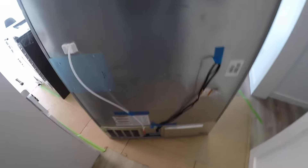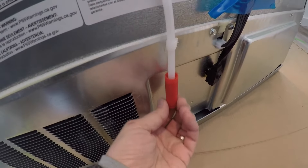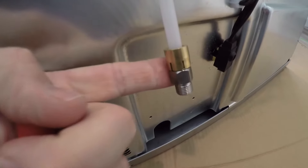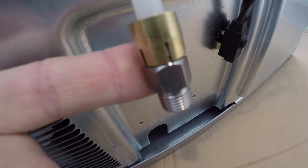This is a new house, and that's the ice maker water line valve right there. And this is the back of the refrigerator — you can see here this is the water line itself that goes to the ice maker. It has a protective covering on it, and when we get ready to hook it up we'll just pop this off. That's our threaded connection right there, and that's going to go to that braided line I showed you.